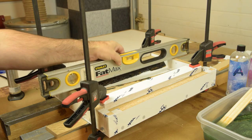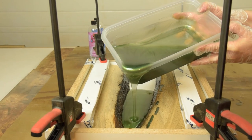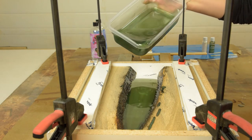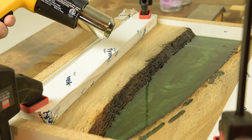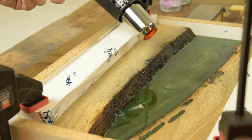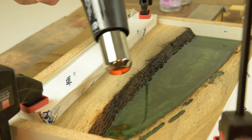While the bubbles are rising up out of the epoxy, just take a minute to level the form in both directions. If you're not level, use little wooden wedges to level the box. So we'll go ahead and do the first pour — she's got a lot of nice emerald green mica stirred in, but none of the pearl white yet. The goal is to get this all halfway or at least partway filled up, filling that channel between the two pieces of white oak. You need to use some heat source to flame out the bubbles. When it's low in the pour like this, a heat gun works fine — it generates a lot of heat so it can pull those bubbles up to the surface. On the second pour I'll probably switch to a little butane-powered torch, just because it doesn't move the epoxy around as much, but both will do a decent job at quickly removing the bubbles.